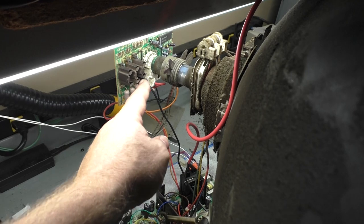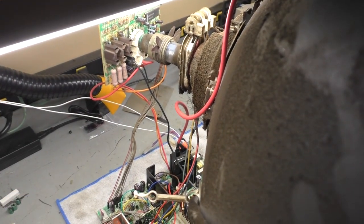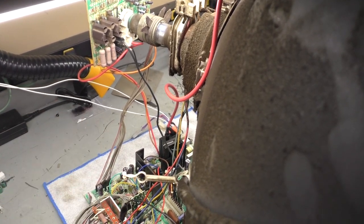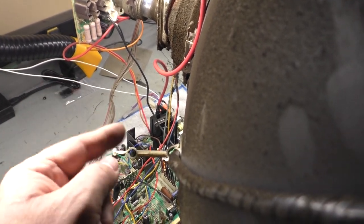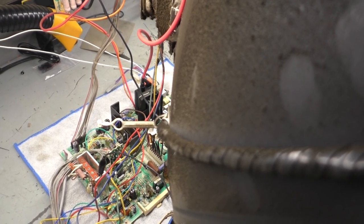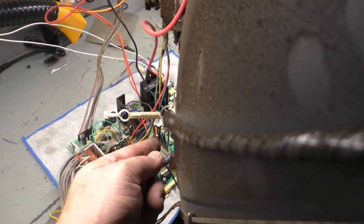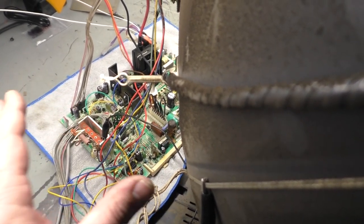So I changed all three of them, and after I got that done, I hooked it back up. When I did that, it fired up. I got a weird wavy image on the screen, and then it zapped itself dead. And it went tick, tick, tick. I just wanted to throw this against the wall and say, sorry, I can't fix it. So I took it back off, and I took W159 back out, redid the light bulb test, and the light bulb was going flash, flash, flash, and it was still going tick, tick, tick.